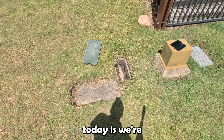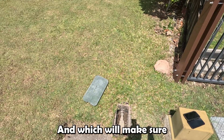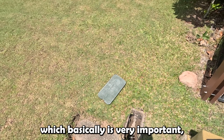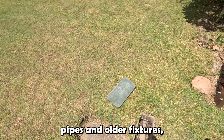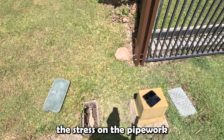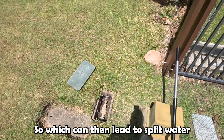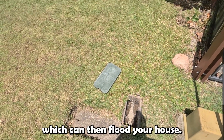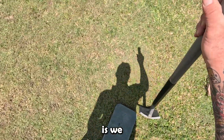What we are doing today is we're going to install a pressure reduction valve down here at the water meter, which will make sure that the water pressure never exceeds 500 kPa. This is very important especially for an older home like this that's got older water pipes and older fixtures, because any higher than 500 kPa increases the stress on the pipework and the fixtures, which can then lead to split water pipes in the walls and under the basins, which can then flood your house.